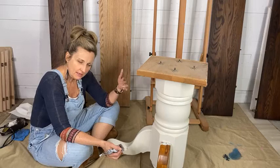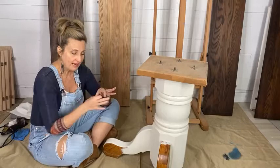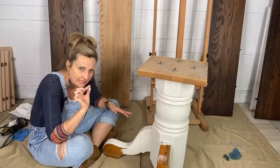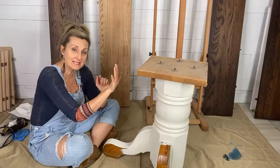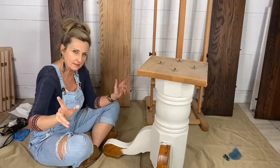It depends. I would just paint the whole drawer again. Is that what you're asking? That's what I would do. But before I paint the whole drawer again, if there's a small area of paint that's just missing, I get a real fine grit sandpaper and sand it back as much as I can in that little area. Then I put a little bit of paint on my finger and fill that little chipped area to get it the same depth as if it had another coat on it. I let that dry, then use that real fine grit again to sand it flat. Then I do one big coat over the whole space again. Does that make sense? Try to get that level the same.